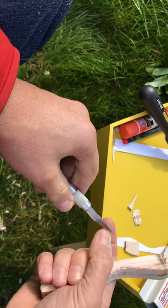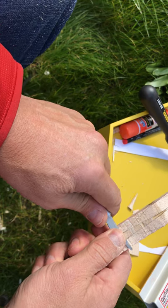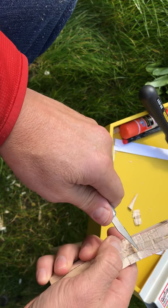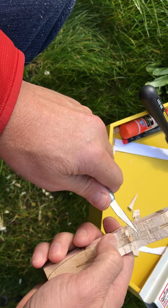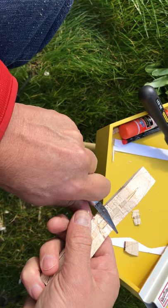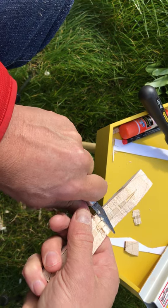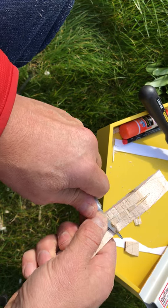You want a longer, sharp blade with an edge that you can push against with your thumb. You don't want an edge on this side — you definitely want to be able to push on that and have a sharp edge there so that you can really control and do kind of small scale, careful shaves to get the exact shape you want.